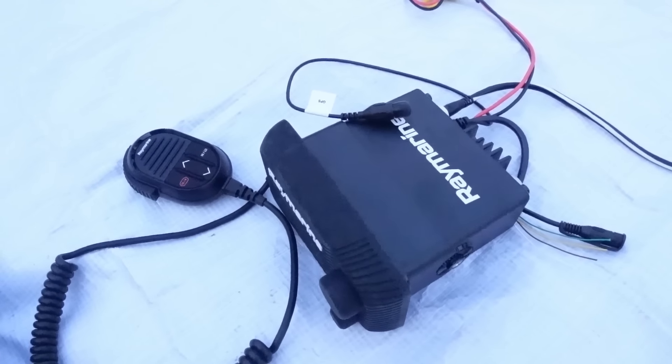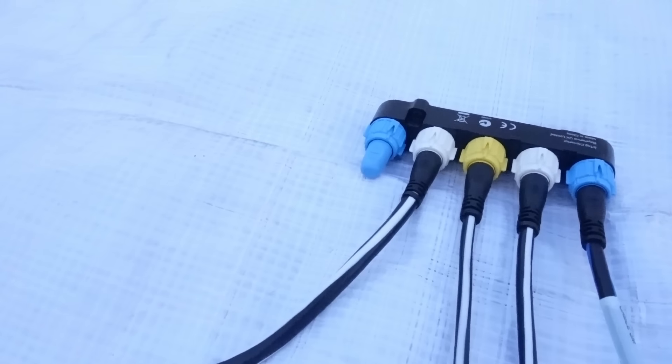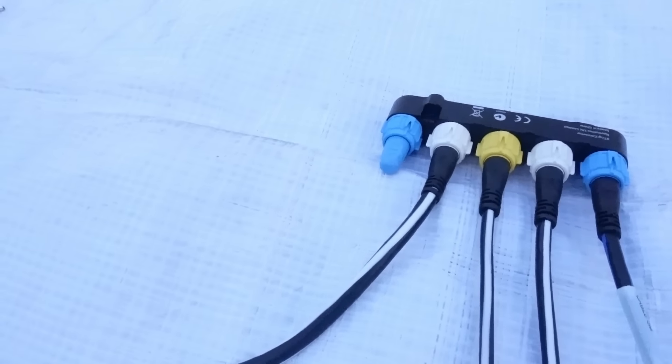Hopefully the wire and aerial are all good on this boat. Going back to the converter block, there's a blue cap on the end which caps off the network. That line of network runs through this blue line over to that block and then finishes in the ITC-5. So it's effectively just a bunch of lines coming off of one string that runs across and goes into those devices. Overall a very simple network, but it can get confusing when figuring out what to buy. I definitely recommend contacting marine shops or even Raymarine themselves — they'll help you figure out what you need.